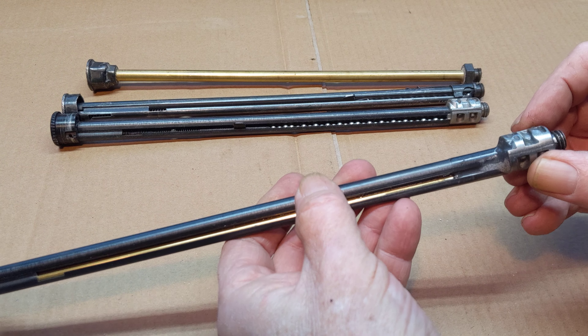To understand what's going on with this, let's take a look at this — which is exactly the same shot tube, except this is one that Daisy has built. Same end cap, same metal sleeving the barrel assembly, same feed ramp, same feed port, spring, follower guide, and packed full of BBs down to the magnetized mount, as you can see here. Now, to give you an idea of what's going on inside, let's look at an earlier iteration, because these 50-round magazines have been a Daisy product ever since the Model 25 was introduced — going back a long, long way. As you can see, we have the spring guide, we have the tube that holds 50 BBs, and you can actually watch little BBs marching down the tube heading for the firing point. Here is a critical detail: the BBs make a turn, and there is a hole right there that they pop into that allows them to get into the actual barrel to be fired. So that's the loading port.